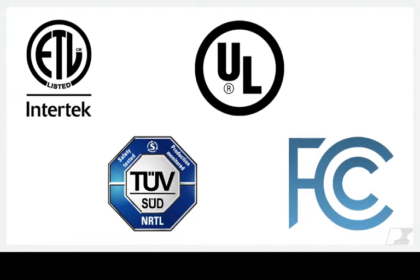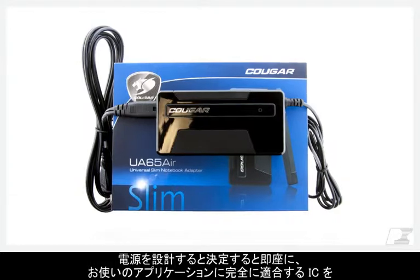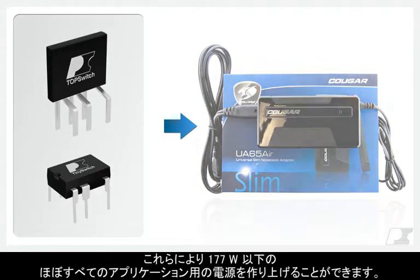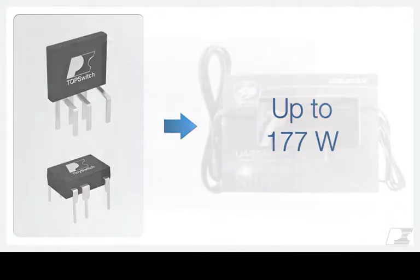They help improve your chances for passing regulatory requirements on the first try and eliminate much of the hassle of development and delivery. Once you have made the decision to design your own power supply, you are ready to select the IC that fits your application perfectly. The TopSwitch and TinySwitch families are flexible offline ICs that will allow you to build a power supply for almost any application under 177 watts.